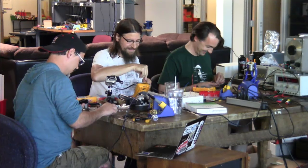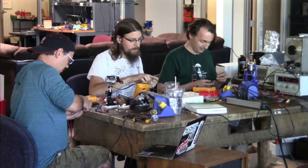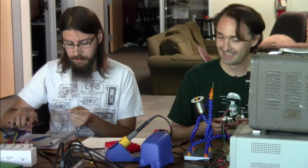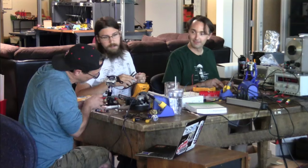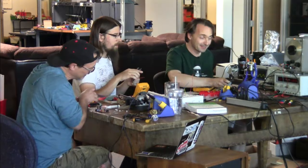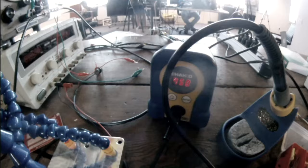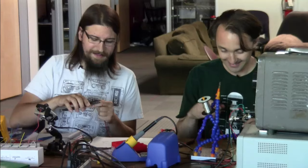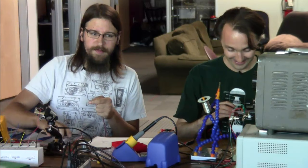Another question, do you have any tips on soldering temperature? That's a good question. 750? Mine says I'm a little over 750, maybe 760, 400 plus on the Celsius. But you usually don't run 750 in your office. Uh-oh. I thought I've seen it a little closer. Because that one's rated Celsius. Oh, okay. That's the only reason. Sometimes I'll turn mine down to about 550 to 600.